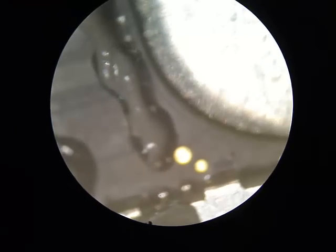Instead of the other solder paste — the lead-free solder paste, which does not contain lead — the traditional solder paste melts at 183 degrees Celsius. That 45 to 50 degree Celsius difference makes a huge difference for this repair, in my opinion.